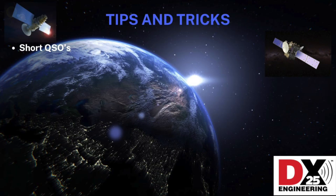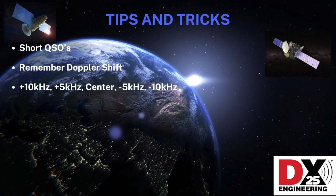Here are some things to remember before making your first satellite QSO. FM satellites usually have a lot of people waiting to make a contact, so keep your QSO short and leave room for others. Remember that the satellite is traveling at over 17,000 miles per hour, so you only have a small window for a contact. Remember Doppler Shift, especially on 70 centimeters and above. For satellites that you're interested in, set up your radio with five 70-centimeter frequencies for each bird: plus 10, plus 5, center frequency, minus 5, and minus 10. And don't forget the PL tone.